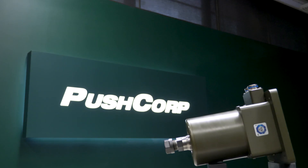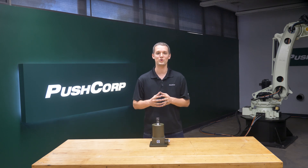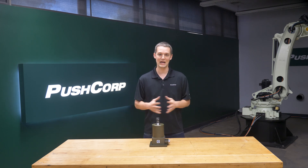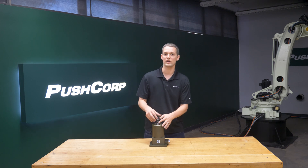The use of an SM1503 PushCorp spindle provided the torque and constant RPMs to produce repeatable cuts. The liquid-cooled spindle has a max RPM of 15,000 and 3 horsepower. These routing applications used hard tooling, so the spindle's manual ER collet was a good option.